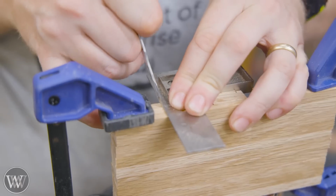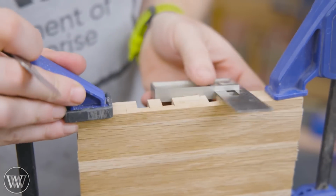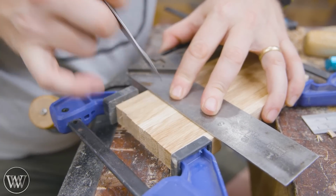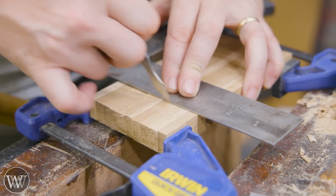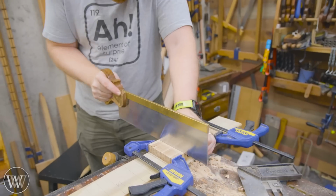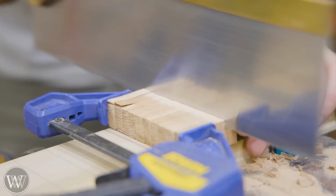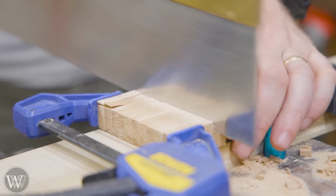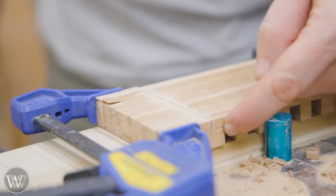Want to make sure that these are all cut down to the opposite thickness of what we cut from the other ones so that they overlap. If my line was exactly in the middle of the board, great. But as long as I measure both down from the top or both down from the bottom, that's all that matters. For the rabbet on either end, well, actually it's a rabbet in this orientation, or it would be a notch in the, we're cutting down doing the same thing here.